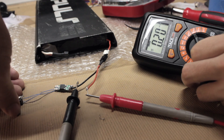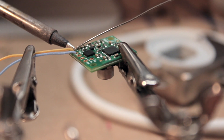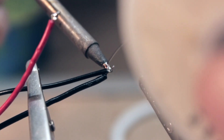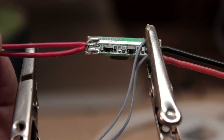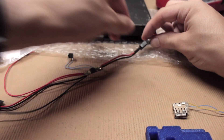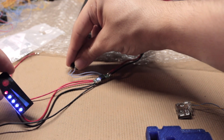Next, I added some power and ground cables to my USB port, soldered those to the output of the Pololu step-down converter, and added some power and ground inputs to the converter. Since I need the battery indicator and converter to turn on at the same time, I went ahead and wired their power and ground cables together in parallel respectively. With those wired together, I soldered the power and ground to the soft latch. With a press of the button, we can see that my battery is fully charged. Perfect.